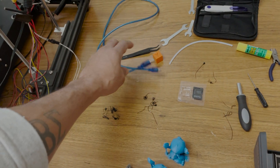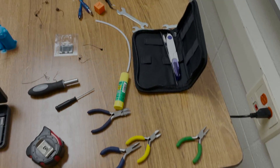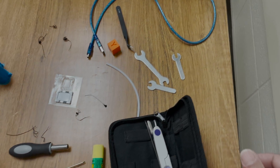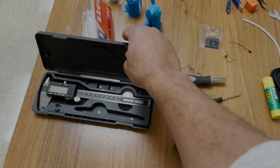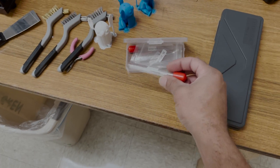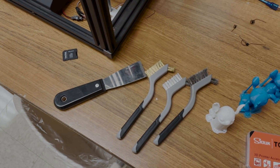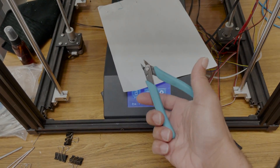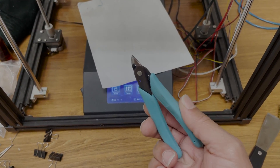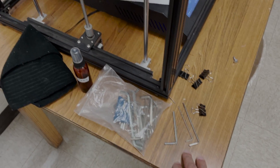This cord is one we would use in case we did not want to use our SD card. I think that is about it. You'll want a few wrenches so you can take apart everything you need. As long as you've got a micrometer if you want to be exact, gauge needles to clean out your nozzles, fine tweezers, angled clippers — a secret is to go to the beauty store and get cuticle clippers — clamps, Allen wrenches, alcohol, and a microfiber rag.